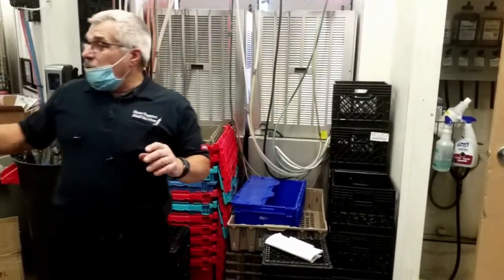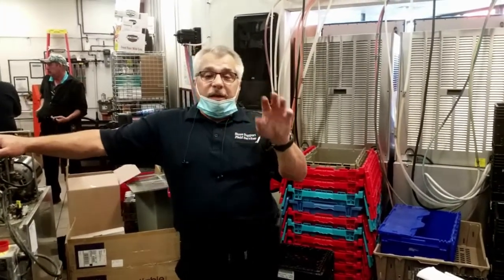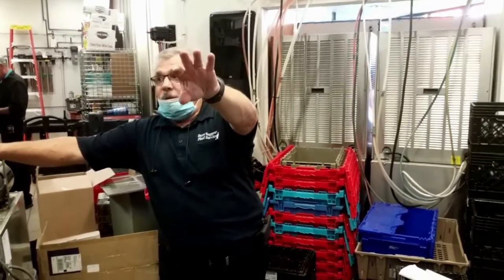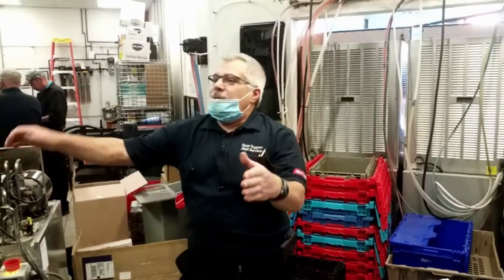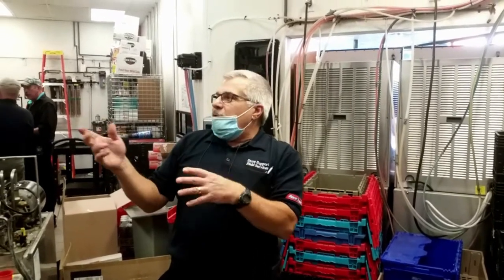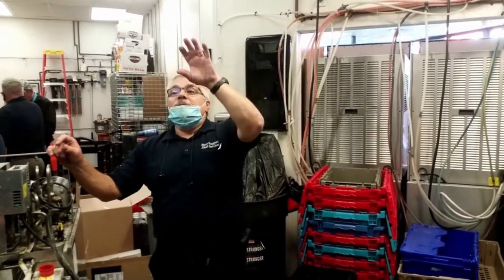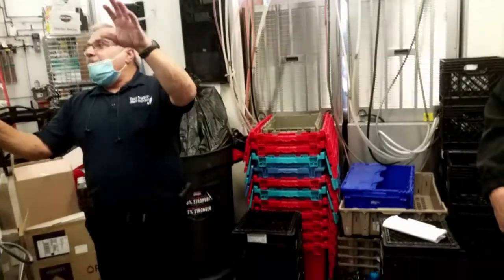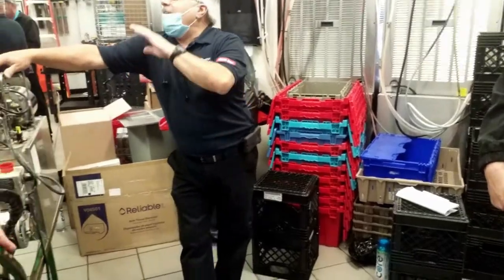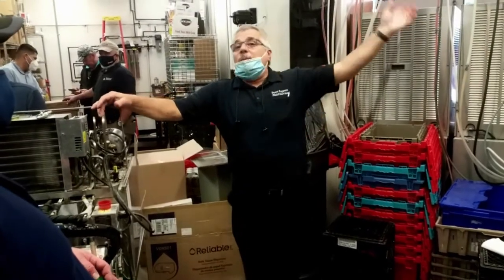However, on the newer stores, the 6Ks and up, when they've installed all this equipment, they've hooked the flow jet pumps up for the FCB machines to CO2. They hook them up to the CO2 tank because that's a constant pressure. It always stays the same, and you'll probably never see a syrup error when you're filling an FCB machine when they're on CO2. Maybe, yes, right. That's another ball game. So, right, so you will see them. Why don't they hook them all to CO2?